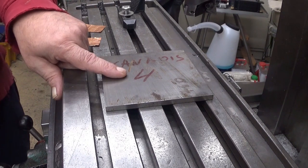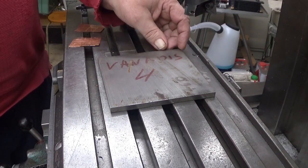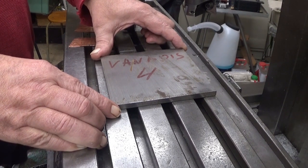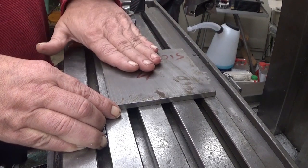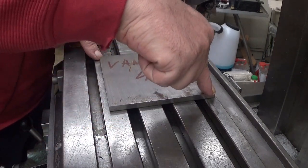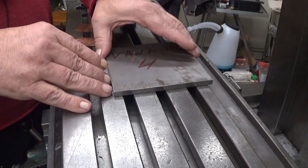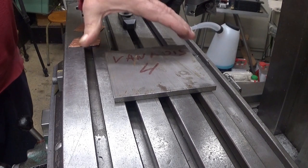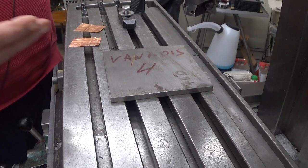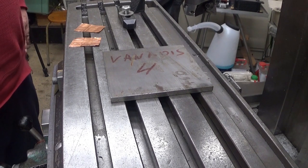Well, we have here a piece of material that I'm now going to use for these vanes. We need 6 of them. Anyway, what we need to do is to fix this in this table. And there is a problem, because I need them to be absolutely straight. So now if I try to wiggle this, it's crooked in each and every possible way. So how to do this then? Namely, if I now just clamp it from there and try to clean it up, when I loosen those clamps, it will spring back to its crooked state. And there you are, you didn't achieve anything with that cleanup.